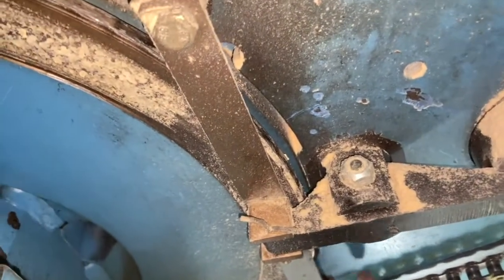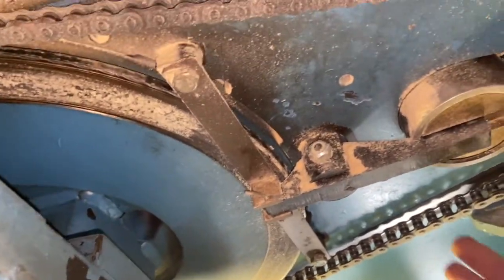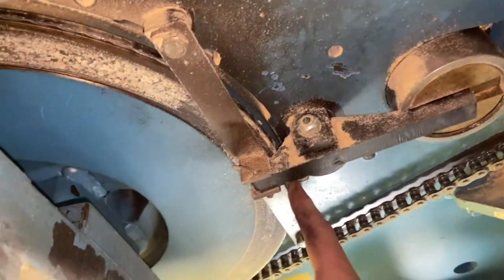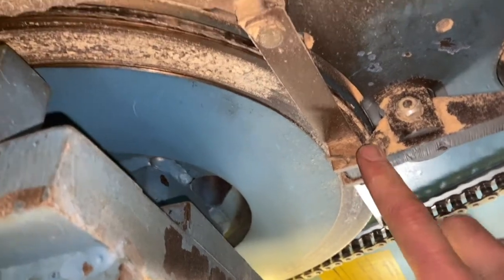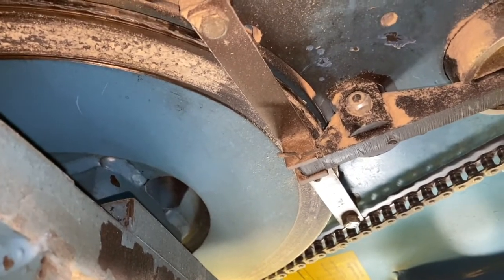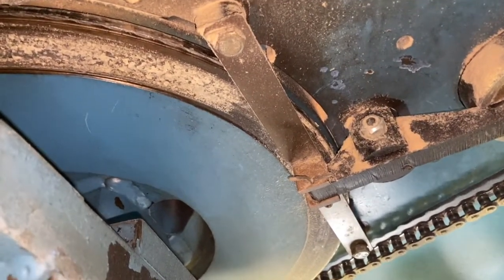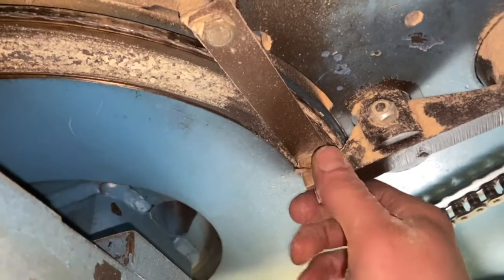This is the brake strap — it's a steel strap that goes across the angle brake. It should also be noted that this brake is not like a brake on your car; it doesn't stop the saw from spinning. The stopping of the saw is done entirely by the angle drive motor. All this brake does is engage to hold the saw in place after it's found its position. It's just set to hold it in place — it's like a parking brake on a car.